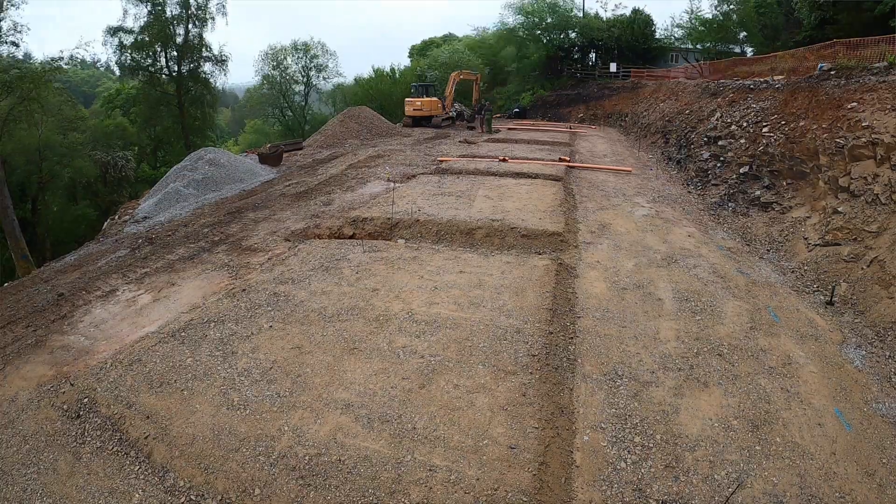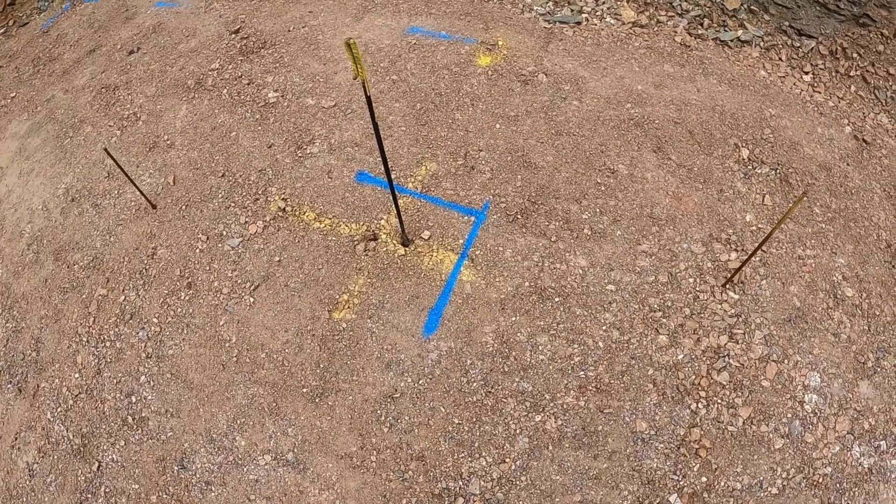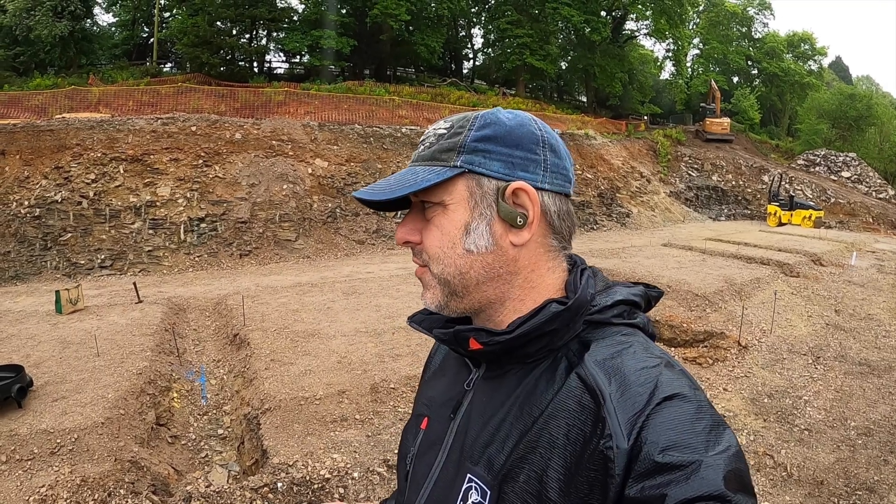So today I'm going to be putting the soil pipes in the locations and checking the fittings are correct. I spent a day getting the X and Ys of the soil pipe locations where they penetrate through the slab, because if you get those wrong and the slab's cast then you're really in trouble. If you're too far away from an internal wall, how do you recover that distance? You've got a certain amount in the floor makeup where you might be able to add a bend or a flexible joint, but really you want the soil pipe sticking through in the exact position because when the slab goes in it's set in stone.